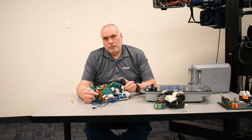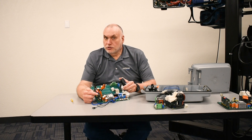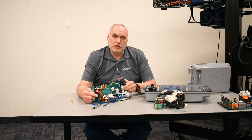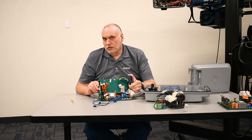Always remember that the E-Prom chip must be removed from the old board and carried over to the new board. This must be done with no power on either board when the transfer is happening. It is held in with a plastic push pin — if your plastic push pin is missing, please substitute a small cable tie to secure it in place. This concludes our video showing the basic features you need to be aware of when you change out a new board for an old one.